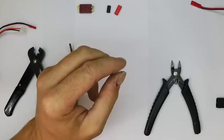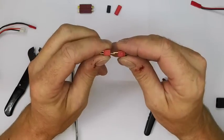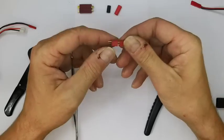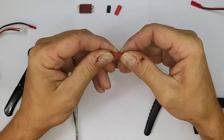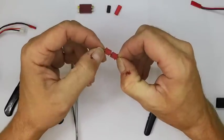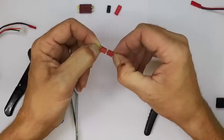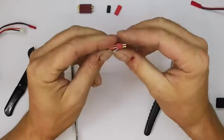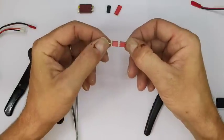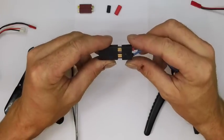Then you have the micro Dean's — a simple connector, but you can plug it in the wrong way if you don't pay attention to polarity, so always work on these as a pair. These are good for things like jumping across shell halves. For example, if you've got a Demolisher running on two IMR batteries and want to replace the connector across the shell halves, this works well. I also use these for Stampedes for the master arming switch when using a FET.